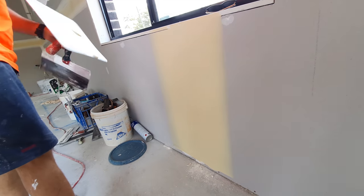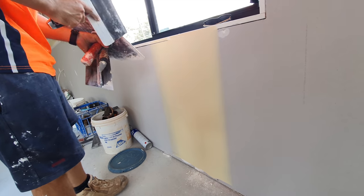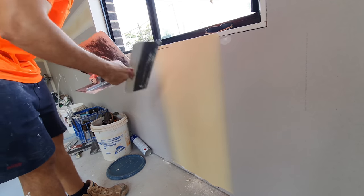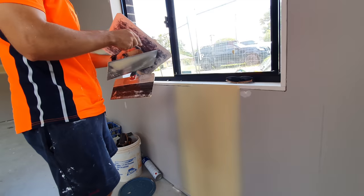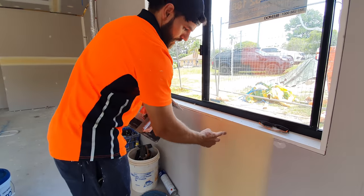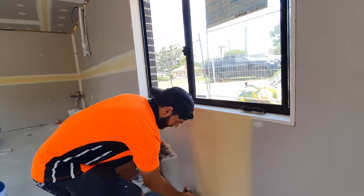I like to use a trowel to put the mud on, but I like to use a knife to get it off, because the knife's a bit smoother. You don't take it all off. Whereas our trowels, they're all bent for external, so if I were to try that I would always leave that cut line. Whereas with the knife, you don't leave that.